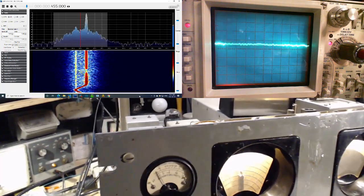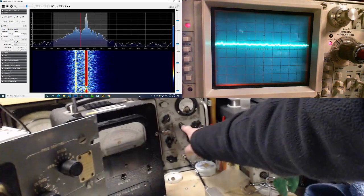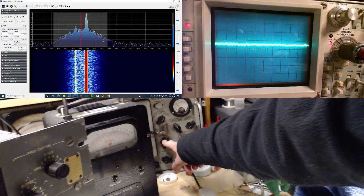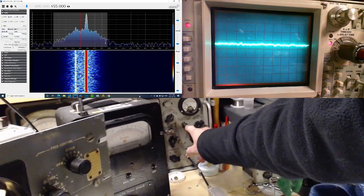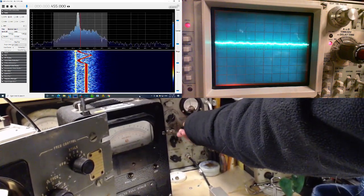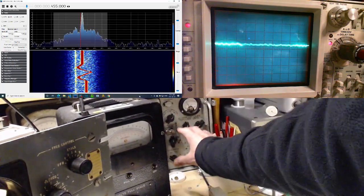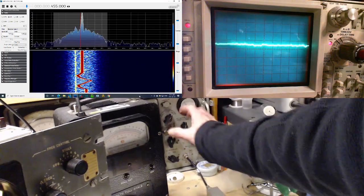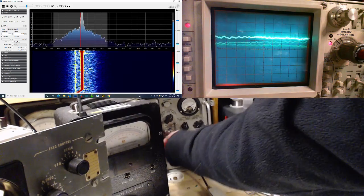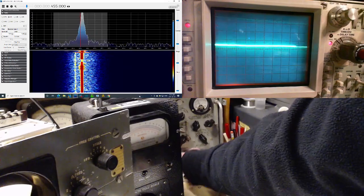own instruments. So on this signal generator, there's a calibration control, it's a set carrier, and then there's an adjustment here, a vernier you can fool around with. If you adjust this one, you see the frequency drifts. I never knew that. So you get this one set though, you calibrate against the meter. Once it's set, you leave it for the frequency you're on. Then if you want to make smooth adjustments, you use this control. And you see, look at that, the frequency doesn't change. So lessons learned all the time.